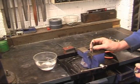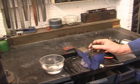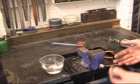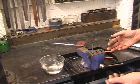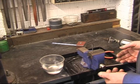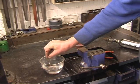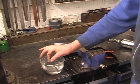It is made from silver steel. Silver steel is easily hardened — you simply heat it up to a cherry red, about 800 degrees, at which stage it becomes non-magnetic. Then you quench it in water, which makes it what they call glass hard — fully hard — but that's actually brittle. Then you fetch it back to colour. The colour I'm looking for is a blue-purple colour, which is what they do gear teeth and springs to. We'll heat it up, quench it in the water. When you quench it, go straight into the water and swirl it round — straight in, swirl it round.